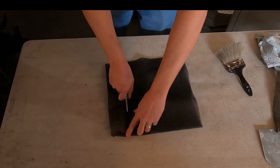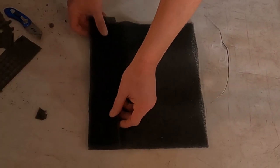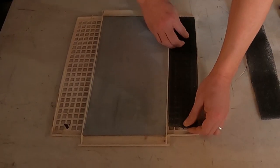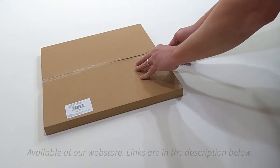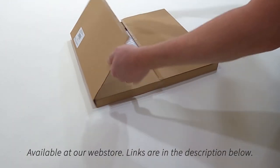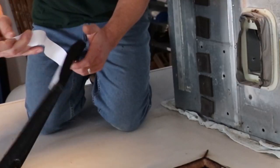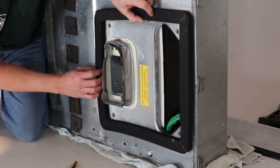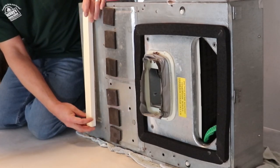We're going to lay our old gaskets on top and cut the correct sizes. Now that the bottom of the air conditioner has had some time to dry, it's time to install the new mounting gasket. Opening our kit, we find instructions, two leveling pads, and the frame gasket. Remove the backing from the AC gasket and install it into place. Press firmly around the entire gasket area. Then choose the correct size leveling pad and install it as well.